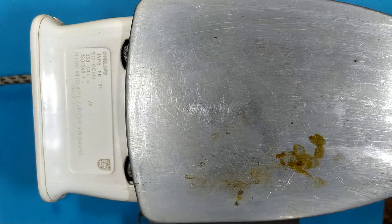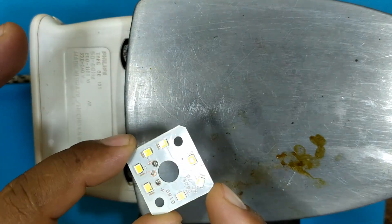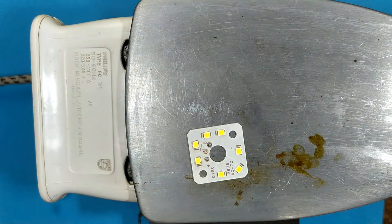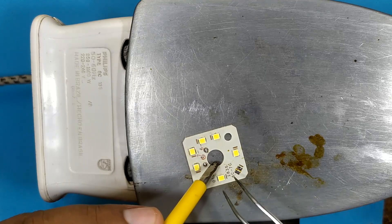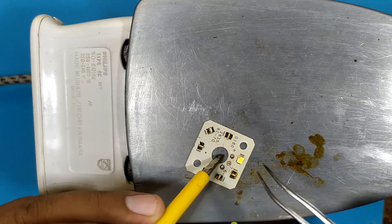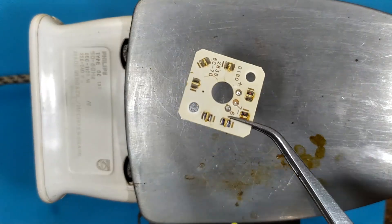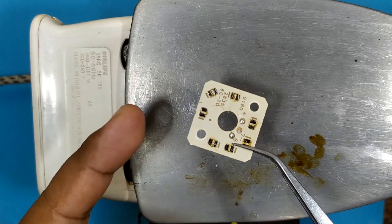Now don't forget that you can remove the LEDs from lamps to be able to recycle them and use them in other projects. To do this we just place the lamp board on the iron as we did with the other board and wait a bit for the components to heat up. If you want you can put flux on it, but if you don't it is not a problem. As you can see the LEDs can be removed very easily. And that's it — as you have just seen we have removed all the LEDs. In this simple way you can remove and recycle them.